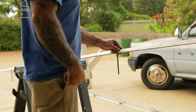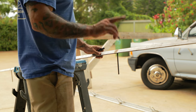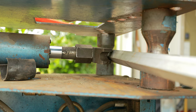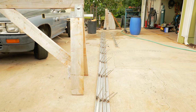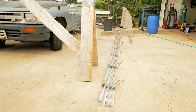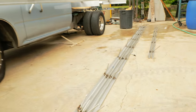We've got a little hump right here — I went a little too far on the first pass, so I'll mark it and put it back in the machine and push it just a little bit the other way. And there it is, the last one, all straightened out again. Just fixing the warpage from welding — that's all I'm doing.